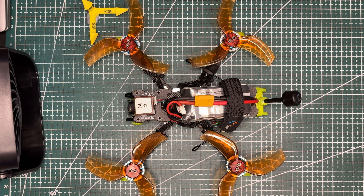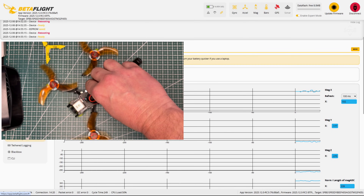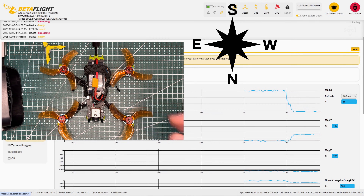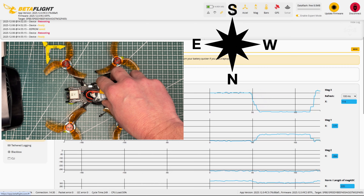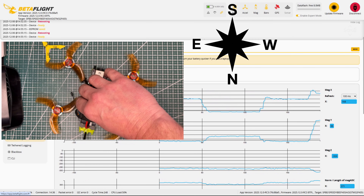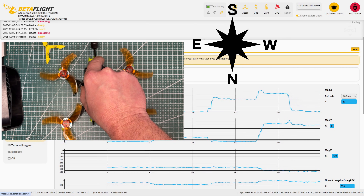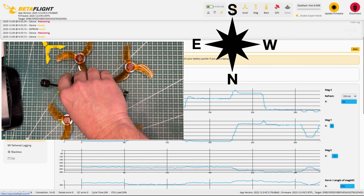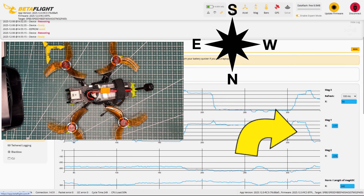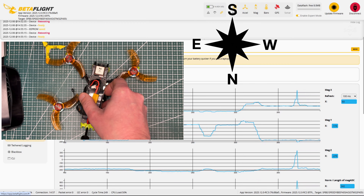Opening the sensor tab to see how the magnetometer behaves — right away I'm getting readings, but they look incorrect. When I point the front X-axis of the quad towards north, the X value actually drops. When I turn the quad east, the X value goes up, and then even higher when I go west, which shouldn't happen — that's already a sign something is wrong. The Y-axis is also wrong. When the left side of the quad is pointing north we should see a high Y reading, but what I'm seeing is the lowest reading on the Y-axis when it's pointing north. So clearly the orientation is not correct.